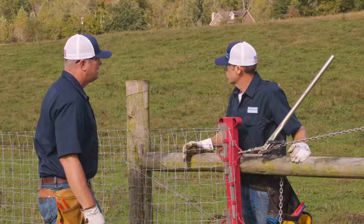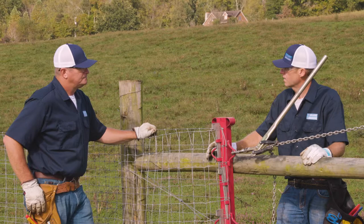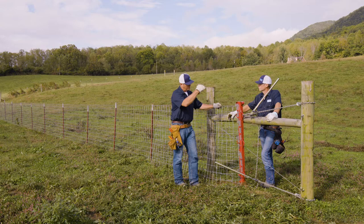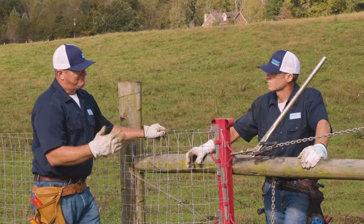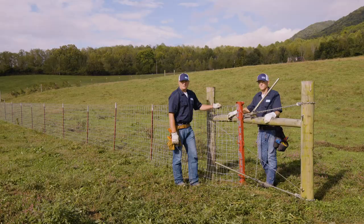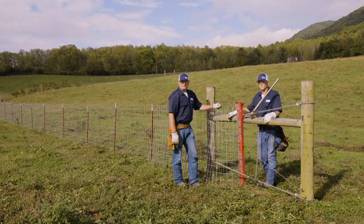We've got a good level pull here. Keith, when working through rough terrain, how do you watch that as you go? I will always leave my stretcher bars and pullers in, then go back to my high points, secure them to the posts, and then pull down into the lows. That way if the fence is a little too tight or I need to take up a little more, I can tell when I go to pull that down. We've got a good flat pull here today. We're going to strip a few knots off, get this terminated, and get back with you to trim this fence out.